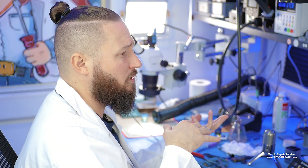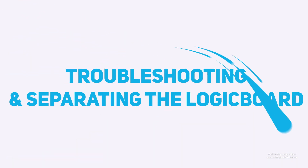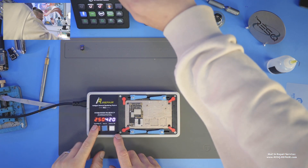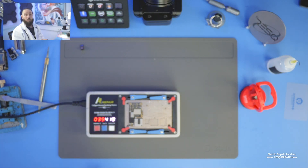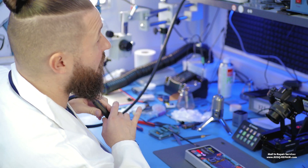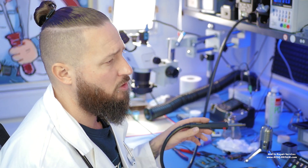It's broken balls between the both halves. But here we have SIM detection and we have IMEI. So let's have a look if we can troubleshoot this no-signal issue. We just heat up the board to 190 degrees, and then we use some hot air to speed up the process. Then we have a look how it looks between the board halves and we take some measurements.